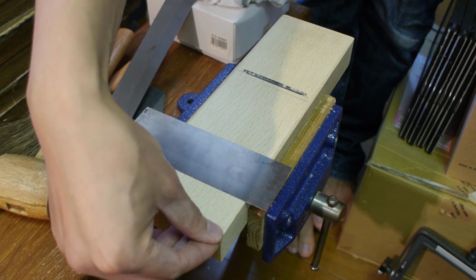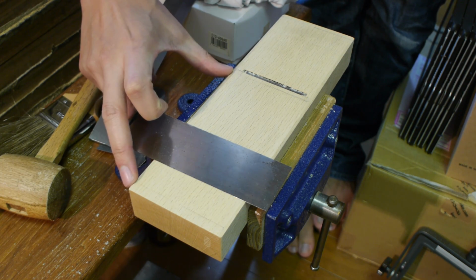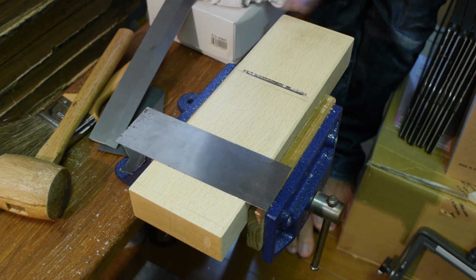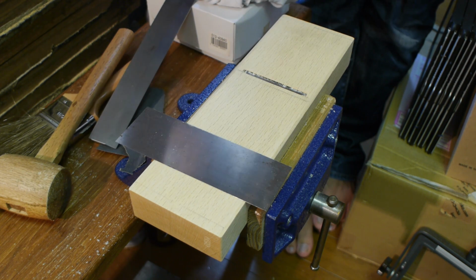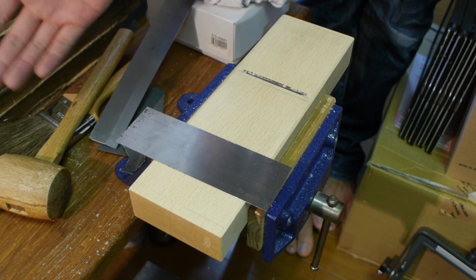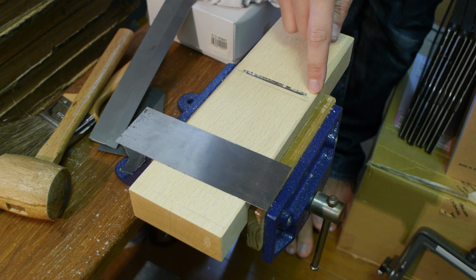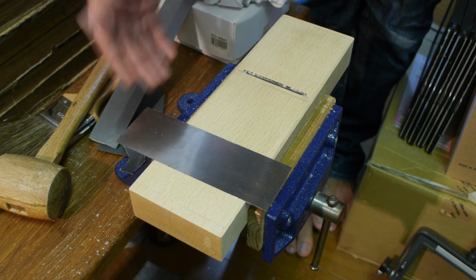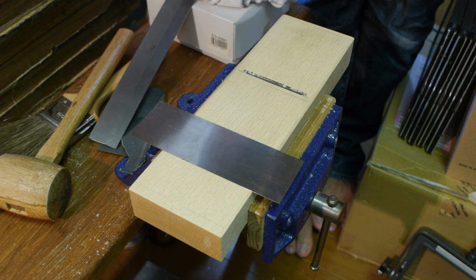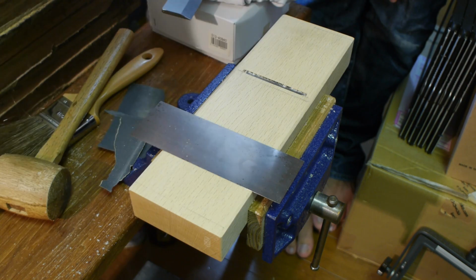Before I continue though, these contact points, traditionally for a finishing plane, they have two contact points, one at the front here, one at the back. All this back area here is scooped out, so there's no contact whatsoever. For the jointer type planes, the truing type planes, there's either two or three, so two here and one at the back, or four strips with an extra one here, just behind the mouth. These are traditionally the jointer planes, etc. They're more the planes for making a flat surface.